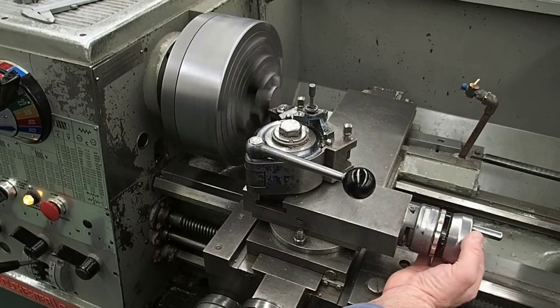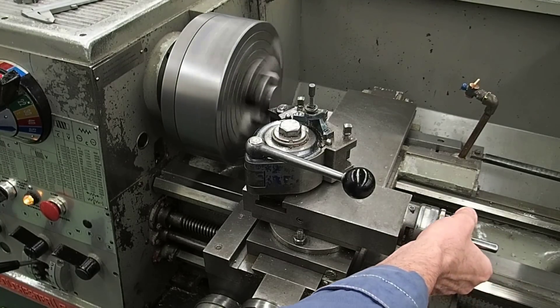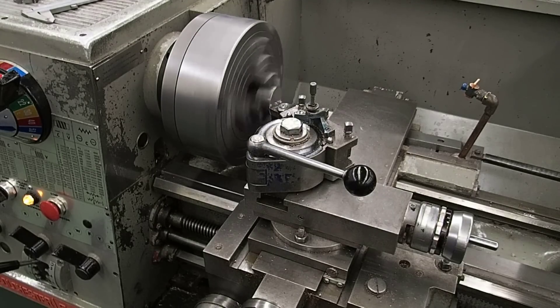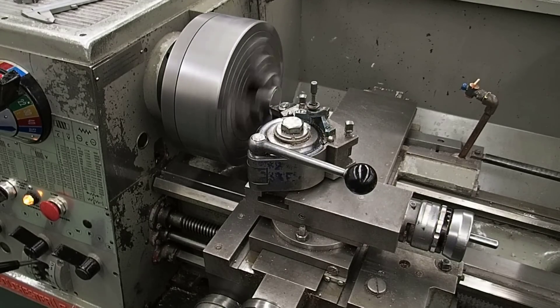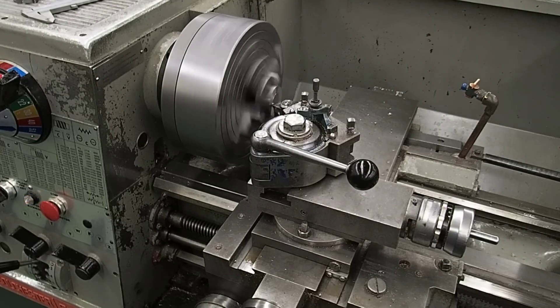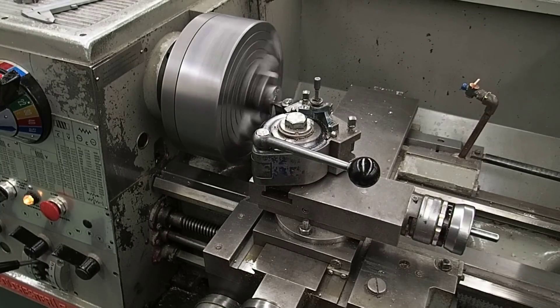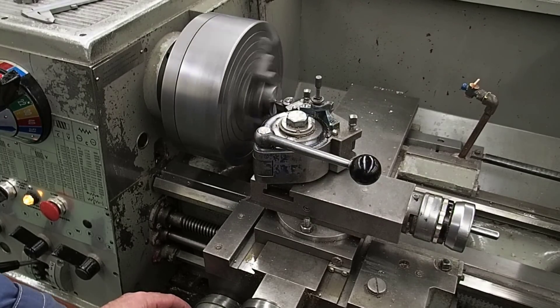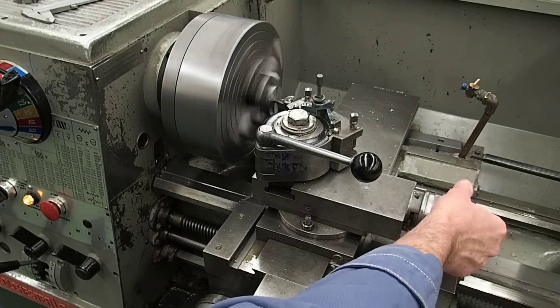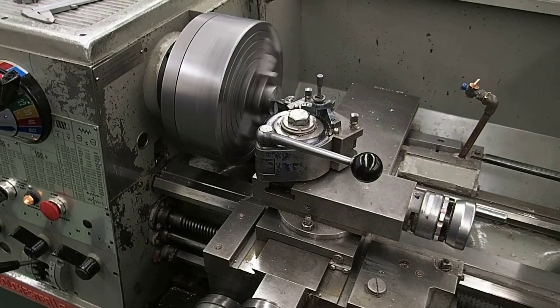I'm going to come out close to the outside diameter, turn it on, and bring the cutting tool up to the work. I'll clear the outside diameter and take a depth of cut - I'm going to try about 15 thou and see if that'll clean up. I'll feed in towards center. Then I'll move the cutting tool away and power off.